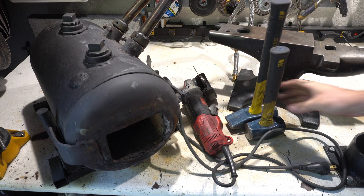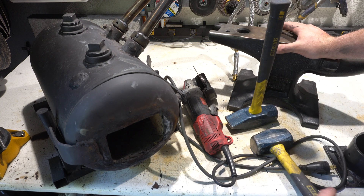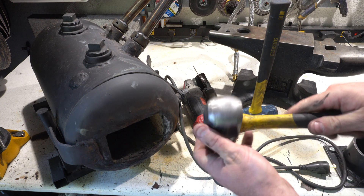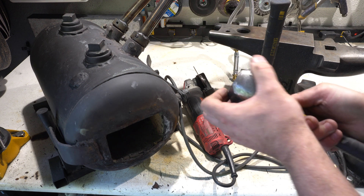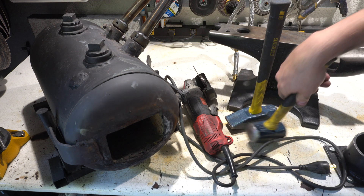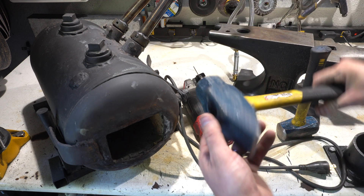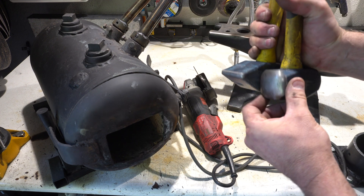Next: hammers. Yes, you can spend hundreds of dollars on an actual blacksmithing rounding hammer. I've got a good friend Spencer who made me one which is my go-to. But this is what I started with — I went to Lowe's or Home Depot and bought a three-pound hammer for around ten dollars. What you need to do is just round off one side, and on the other side round the edges — you've essentially made a rounding hammer. You need the round side to spread metal and the flatter side to make it flat. You can do the same thing with a cross-peen hammer; round out that peen a little bit to spread metal. Go the cheap route and just re-face your hammers from a big box store.